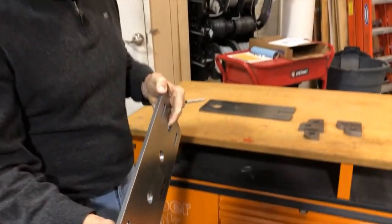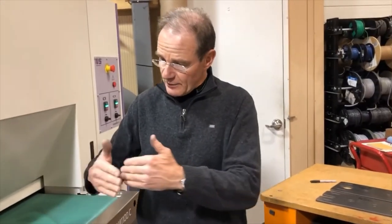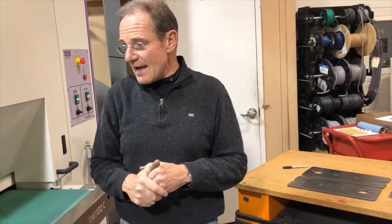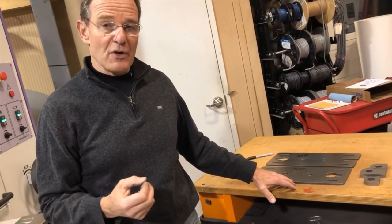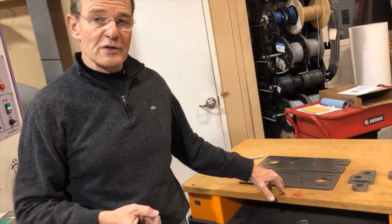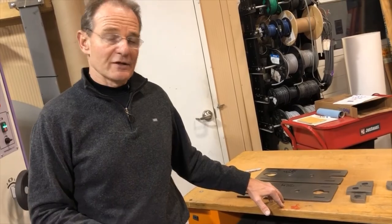I really do not recommend using a wire brush on a machine with a conveyor belt. We have a separate machine where there is a gap underneath the belt so the wire brush can really penetrate into the material. The second reason to separate that process is if you brush outside and have a little bit of oil on your material, it is a horribly messy process and will contaminate your machine — especially if you want to use it for stainless steel or aluminum afterward. We recommend making that a really separate process. Thank you very much.